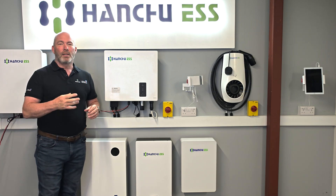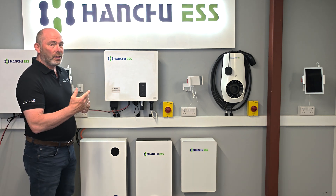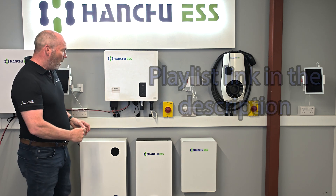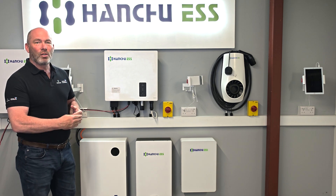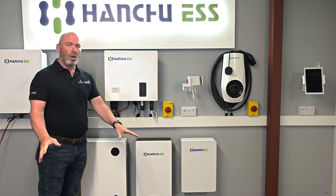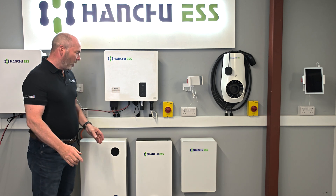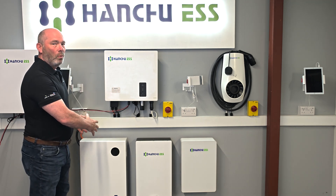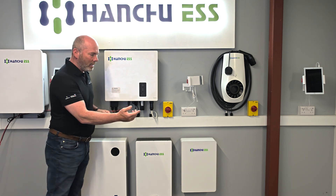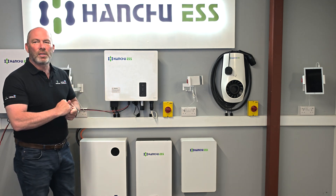When I'm referring to doing an installation, I'm going to refer as if we just had a single battery installation. There's a separate video for if you are doing a number of batteries — four or five or however many you've got. For this we're just going to talk about a single battery. When you get the batteries, take them out of the box and check them, then turn them all off. Even if you've connected all of them up, don't turn them on until we run through a single battery setup. Once we've done that, turn the next battery on, wait 20 seconds, then the next one, wait 20 seconds, just to make sure that the self-addressing process works exactly as we want.